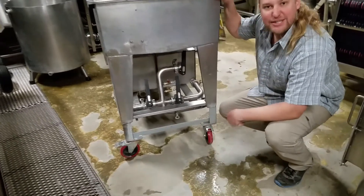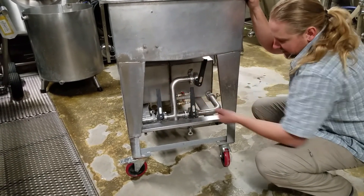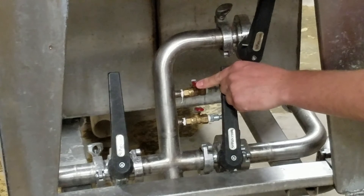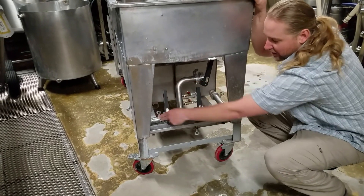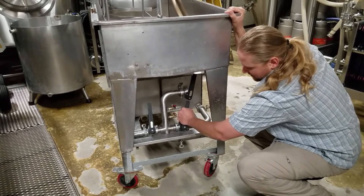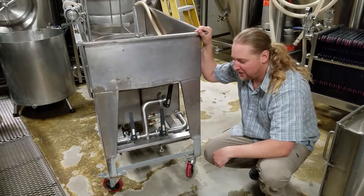This final manifold side is how you control what goes into the pump. Up here is where we hook in our water - to rinse out the beer and chemicals, we open the water side. We have both air and CO2 we can put into the system: air to blow out the caustic and water, CO2 to purge and pressurize the kegs before filling. We have a butterfly valve from our caustic reservoir to bring caustic into the pump, and another to bring the sanitizer reservoir into the loop. That's a simple setup of how we got a keg washer working relatively cheap when we were first starting.